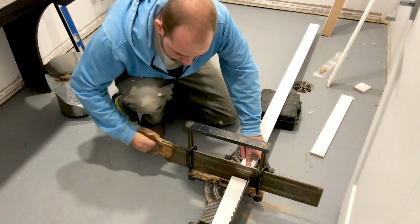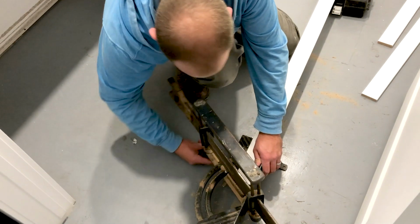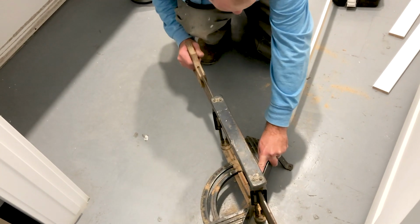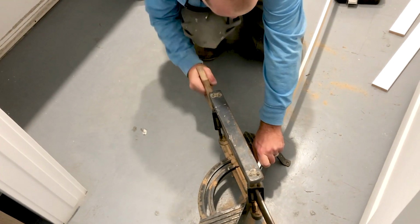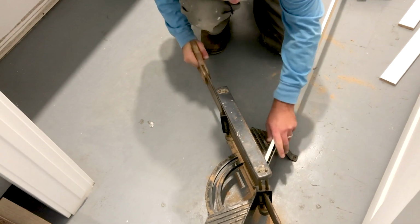Once you have the lines for your top pieces of molding on the wall, you can cut your casings to fit. You'll either cut them at a straight 90-degree angle, or you can turn the boards upwards and cut a mitered 45-degree angle so that the boards rest nicely on top of each other where they need to be spliced together.